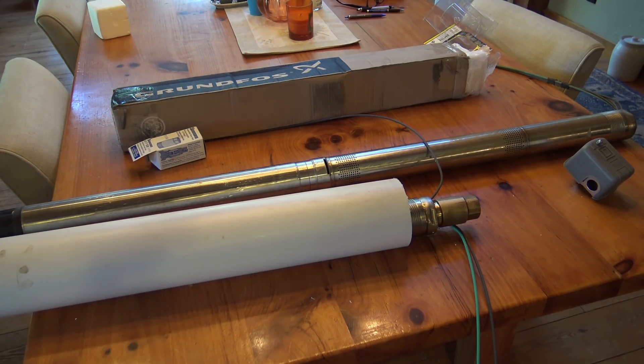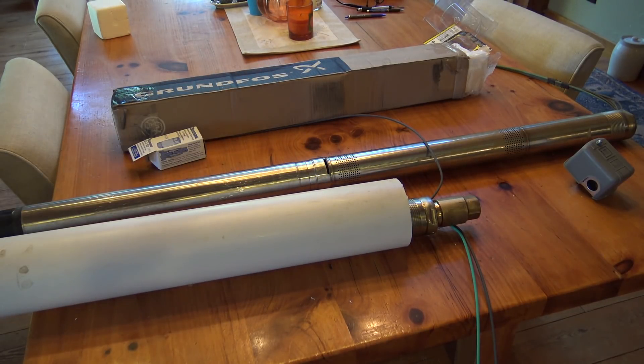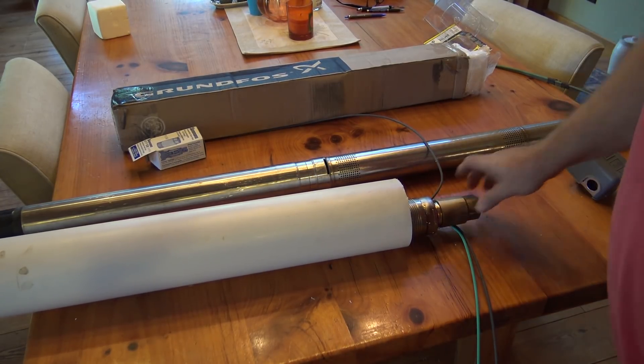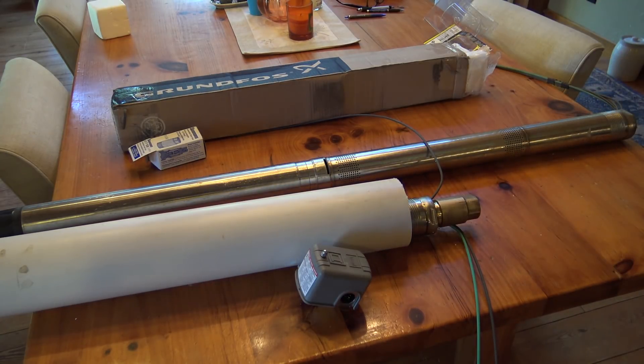What I'm going to install it in is a very cold mountain spring, so I'm not worried about overheating. I don't have the hand pump here, but a lot of times we'll put in a hand pump along with one of these other pumps as a combination. Lots of backups, lots of redundancies — it doesn't cost a lot of money to put in these fail-safes: extra check valves, extra dry run protection. These fail-safes will make your life a lot easier than having to replace the pump, because not many people want to pull pumps out of wells when the failure is something as simple as someone leaving a spigot on and draining the cistern.